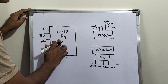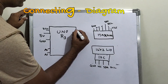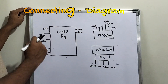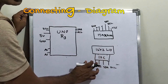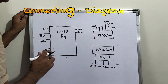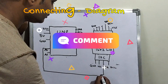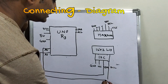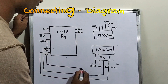Here you can see the Arduino Uno. A4 and A5 are on the left-hand side — those are the SDA and SCL pins on the top right-hand side. Now let us do the connection. Here is the MAX30102, and here is the 16x2 LCD with the I2C extender. Let us connect the I2C first, then we connect the MAX30102. I am taking A4 and connecting it to SDA.